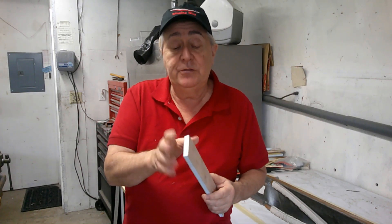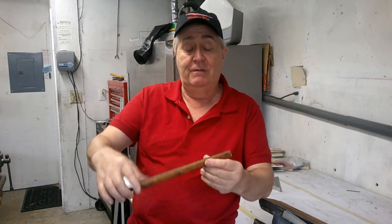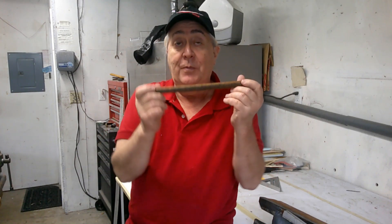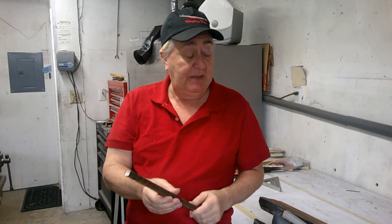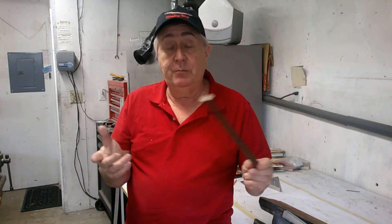This is extremely light core material — similar to what I discuss in another video about foam and honeycomb core. This allowed me to cut the curved shape of the ribs right out of that sandwich. Then came the messy job of putting on the carbon fiber and wrapping it with fiberglass — epoxy dripping everywhere — but we got them done. They took a long time to make, but they're extremely lightweight and just bulletproof strong. And you didn't need molds of any kind, so for a home builder, it's the perfect solution.